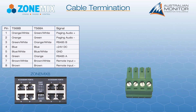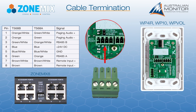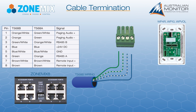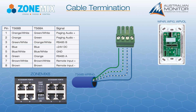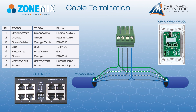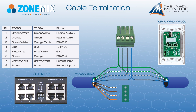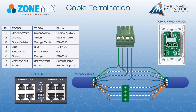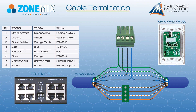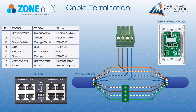The wall panel controllers use 3.81mm Euroblock connectors, which allow for easy connection in tight wall spaces. They use the power and ground and the RS-485 wiring pairs. The Euroblock connectors also allow for easy daisy-chaining of wall panels from the same plug. If you are using the paging or local audio inputs on the cable run, ensure they are joined using a terminal block to the downstream accessory. The wiring shown is the T568B standard; if you are using T568A, the orange and green pairs are flipped.